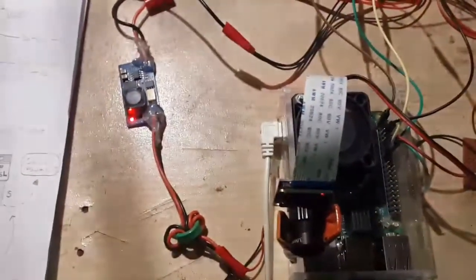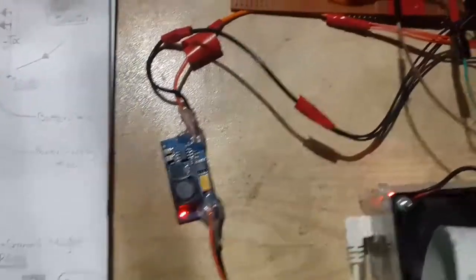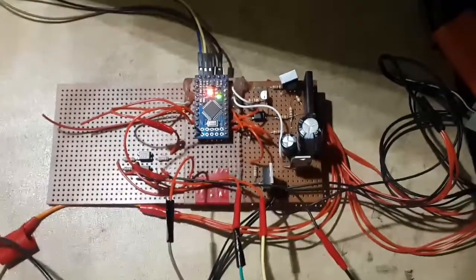This is the circuit for turning it on or off. The main power supply is this AC-to-DC 12-volt power supply. The cooler can also work at lower voltages. The Raspberry Pi itself is powered by this 5-volt plug converter, which can be turned on or off by this circuit, which I made using an Arduino Pro Mini.